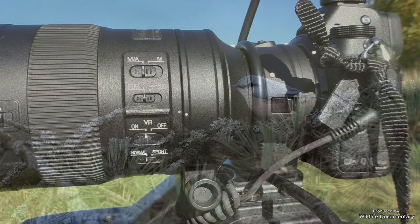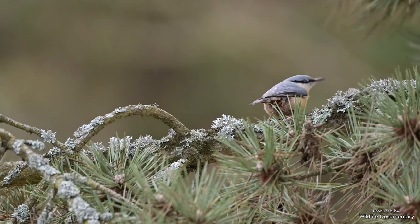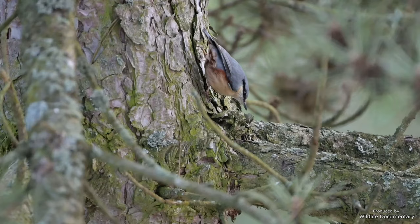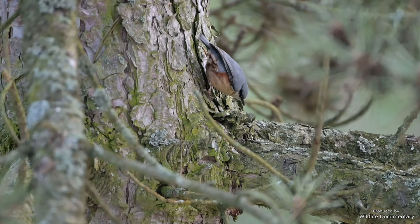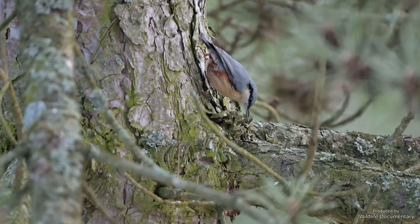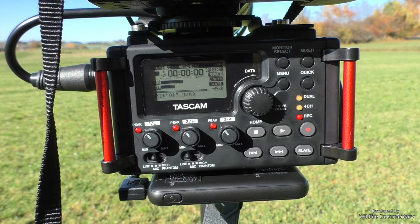Well, first of all, the topic of wildlife filming — especially with regards to birds that are very small, very agile, and usually very shy — is not discussed all too often in combination with this gear. This video series will focus mostly on that and will contain information on many different aspects important for this endeavor, such as the question of audio and sound on this camera, which is rarely covered. This includes the pre-amplifiers of the camera, the lowest noise floor of the quietest setting, what actually is the quietest setting — it is not level 1, by the way — and what different kinds of audio gear work well in combination with this camera.